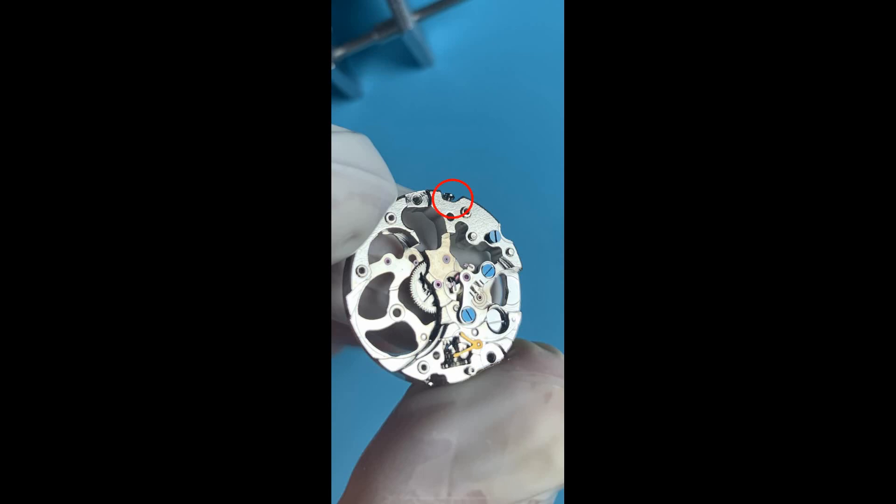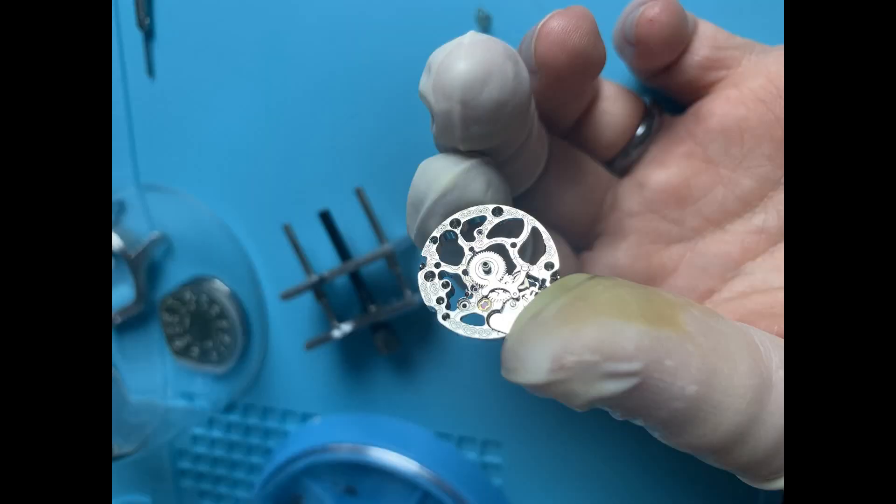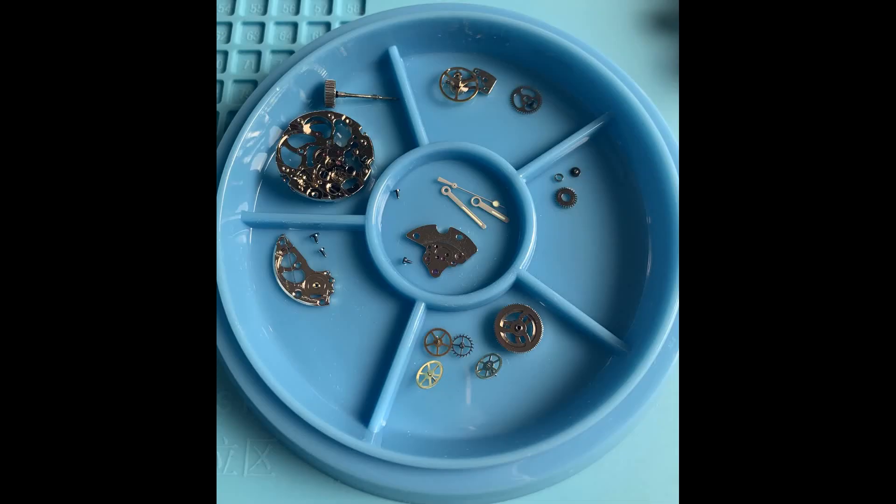You can just make out one of the dial screws at the 12 o'clock position. Here is a much better shot of the decoration on the motion work side. I did not disassemble the keyless works or remove that interesting plate that appears to be retaining the cannon pinion. Here are the parts I stripped down. There are a few more parts — for example, the keyless works as well as the cannon pinion, minute wheel, and hour wheel. Take note here: the balance hacking lever is still attached to the main plate.